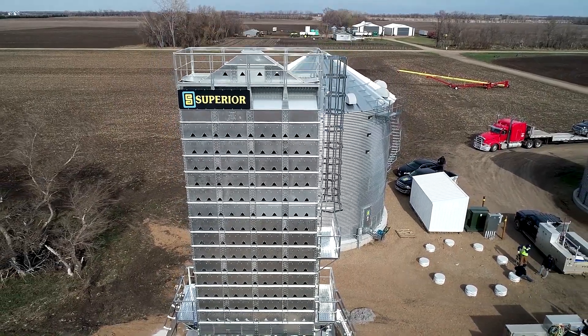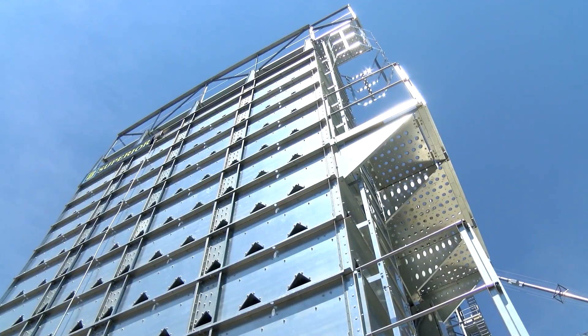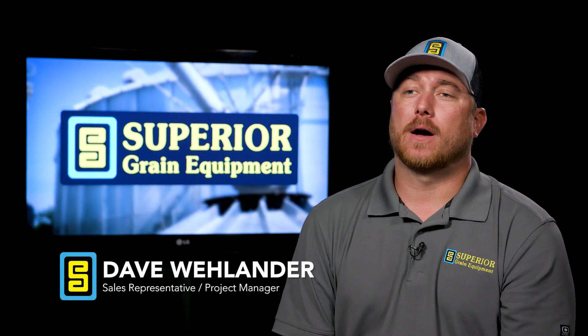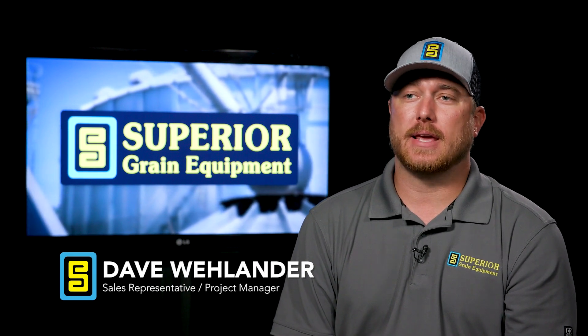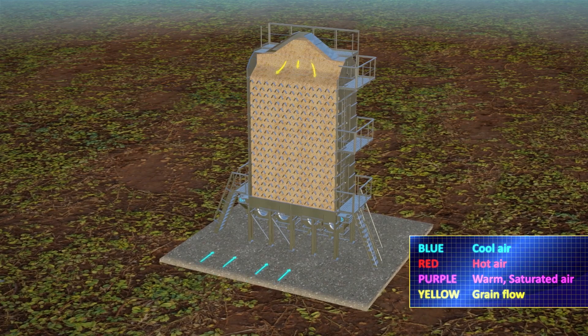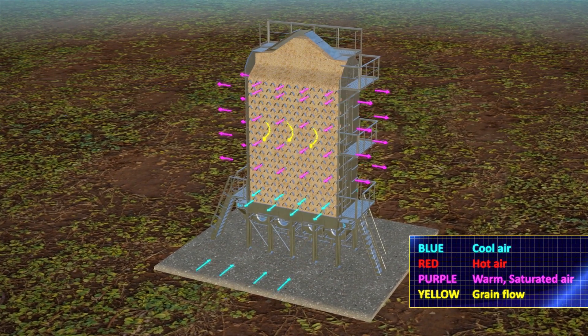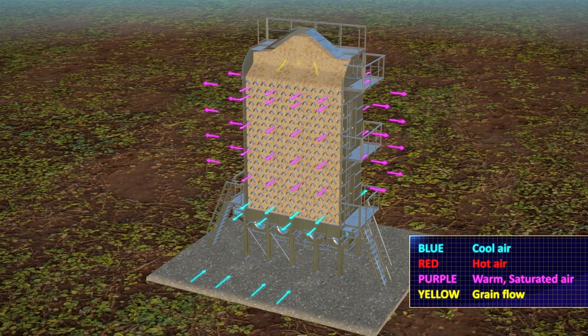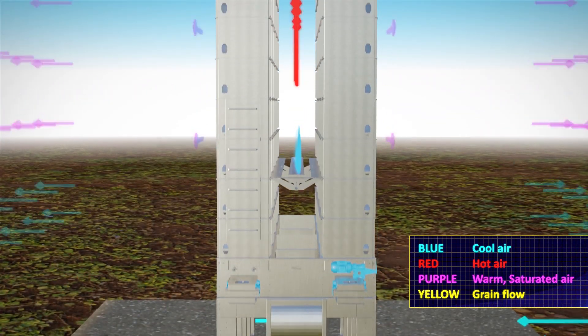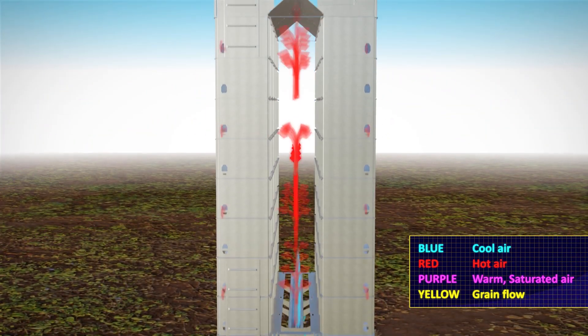Superior's continuous mixed-flow style grain dryer offers several advantages in efficiency, flexibility, and quality. One of the big benefits to an under-fan mixed-flow is even heating from top to bottom, front to back. We heat the grain up gently as it's going through, so less heat means less stress fracturing, and gentle heating and even cooling means there's going to be less damage to the product, which means more dollars coming out.